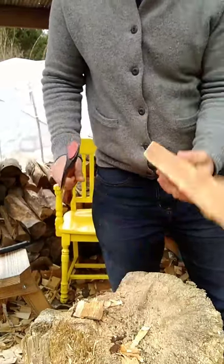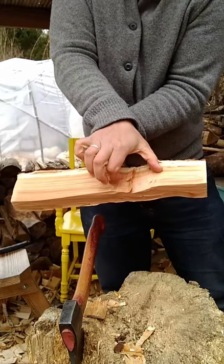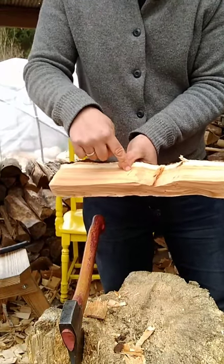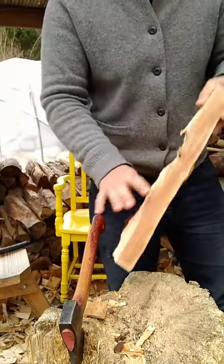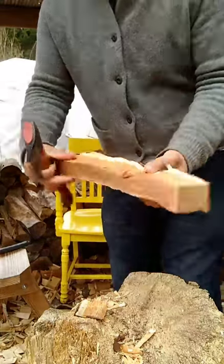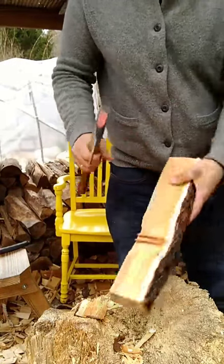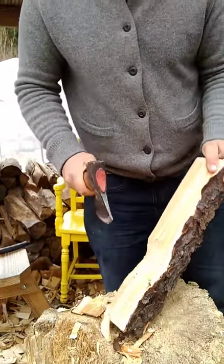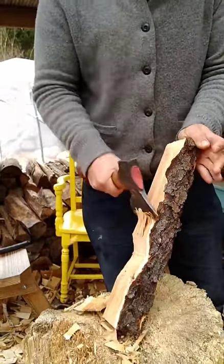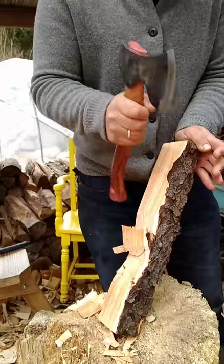What I'm looking for is to have the appropriate angle here and also to have enough distance to fit the bowl that I want. If I'm making a larger spoon, this needs to be longer — I'll back up where I do this stop angled cut. But in this case for an eater, that's just about right. This allows you to double check on the back that you have enough material to fit the spoon in its profile.